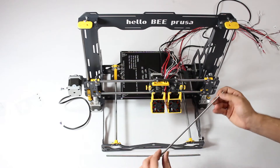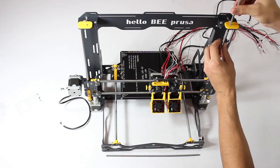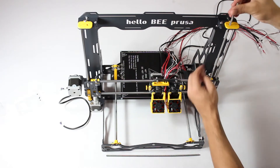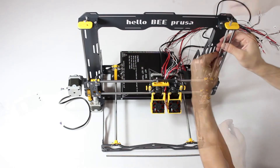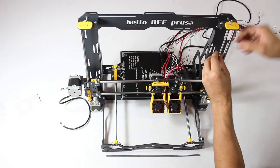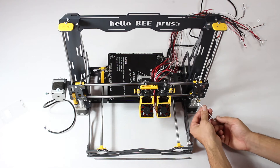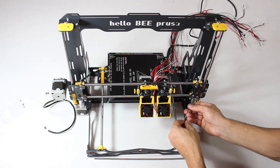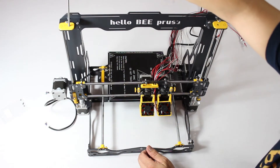The following step is to place the threaded rods into position. Each rod should slide in through the top of the printed piece unimpeded. You must then screw it into the nut inside one of the printed components on the tip of the X axis. The rod then continues to tighten downwards and inserts into the flex coupling. Once it's tightened all the way, fix it in place by tightening the socket set screws inside the coupling. Do the same on the other side.